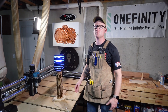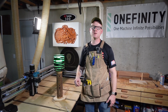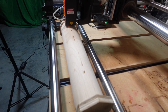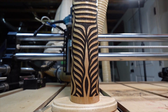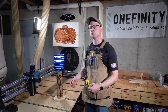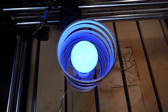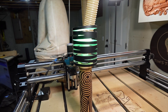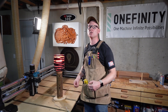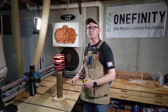Over the last few videos, I was able to create a stock hexagon using my bird's mouth bit. I then used my Onefinity Revolution to carve that hexagon into a cylinder. After that, I laser burned an image produced by ChatGPT onto the surface of the cylinder. Once all of that was done, I was able to cut out a lamp base and a top for the cylinder using my Onefinity Journeyman. All of these smaller projects came together to finish this final product, which is a cool RGB lamp. I'm going to put the links to all of these items in the description below, just in case you want to try this project out for yourself. I've had a blast making this.